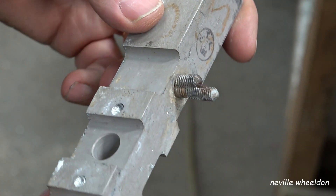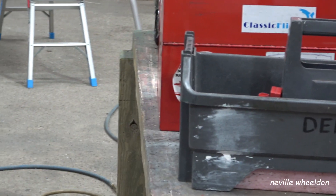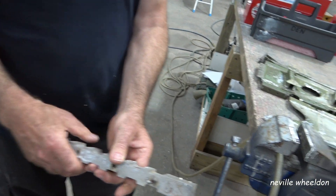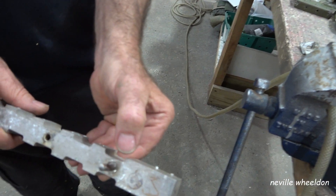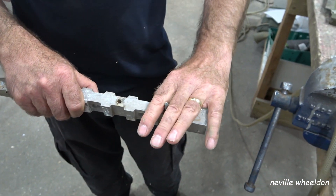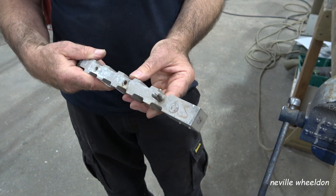Keith was showing me this — fantastic, absolutely classic. It was flying with that! Do you think it'd be a repair or original when it was first made? Oh, that's a repair. They've either been taking the aileron off — because to take the aileron off you don't disconnect it at the hinge, you take the hinges off the top of the wing, complete with the aileron. That bolt shank was totally encased by the anchor nut — you couldn't see it. All you could see was that sticking through, and when we took the anchor nut off — hello!